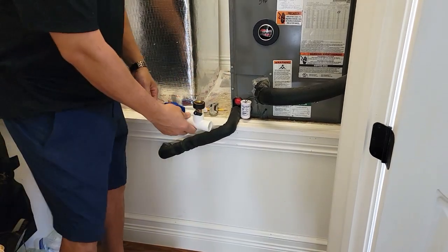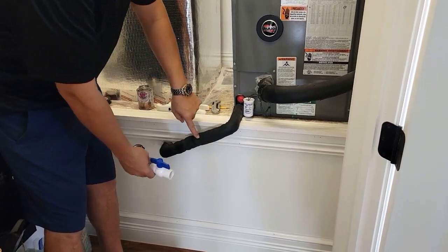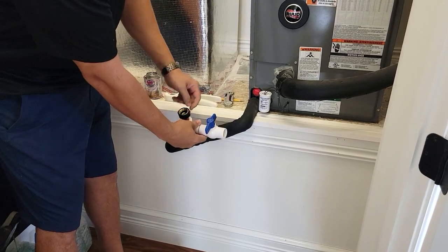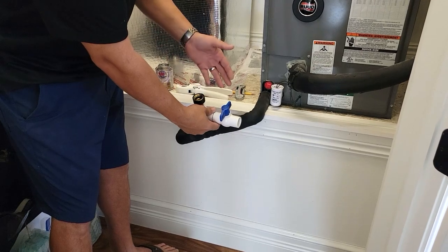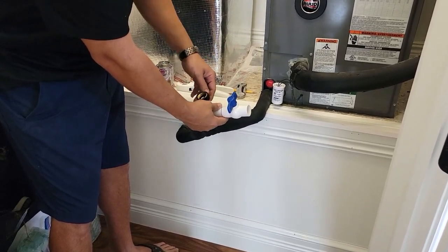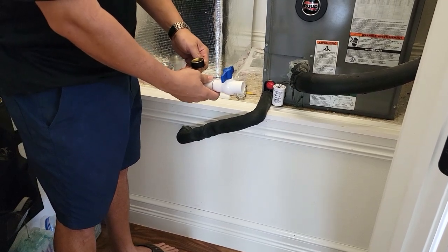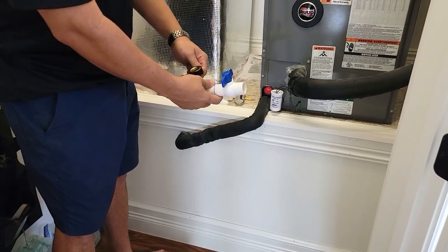The reason why you need this tool is because if you were to just hook a hose or put pressure directly, it would blow back and up into the unit. What this does is allow you to shut off water from going back into the unit, then hook a hose to it and blast with standard 50 to 60 PSI city water pressure all the junk out of your drain line. If you install this tool, you will save all kinds of calls to the air conditioning company, and if you flush it out every six months, you'll never have a clogged drain line ever again.